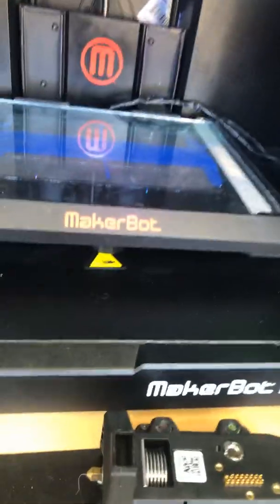Another modification I did is some quick LEDs inside here - makes this thing look really nice. Just throwing in some strips - there is a Thingiverse thing for the little plastic piece that the LED is actually sitting on right now. I also put fans beside my stepper motors because the motors were getting hot. I just took apart a cooling fan kit from a laptop setup that had gone bad, took the fans out of that, and they're also just using the USB from the fan controller.